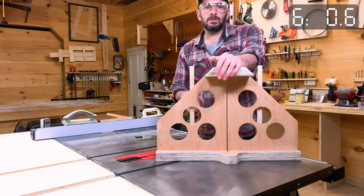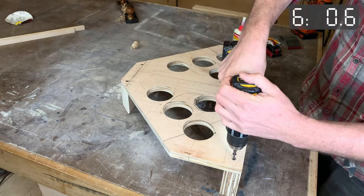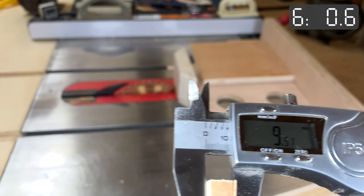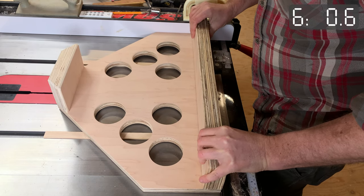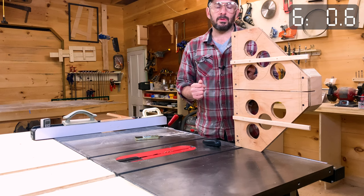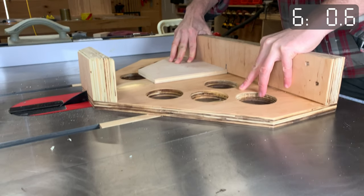The rest of the build is straightforward as crosscut sleds go. I put a block in the back to hold it together and a fence on the front that I squared up using the five-cut method — link below to that video. The runners are ash that I had laying around. I'm hoping ample polyurethane will keep the elements at bay and these won't bind up come August, but if they do I'll rip them off and replace them with plastic. As I said, I find finishing boring, so I'm going to skip over that part. Time to take it for a spin.